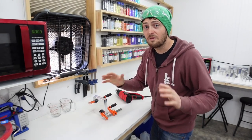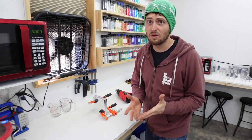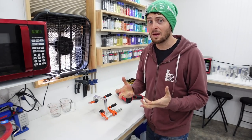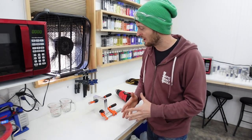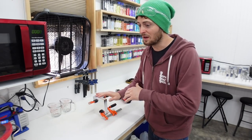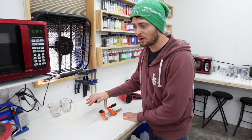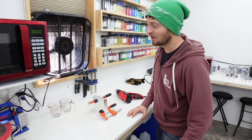That's all nice and warm now. If you're going to shoot laminates, heat up your injectors and your mixing block to make sure you have really good flow - you're not cooling that plastic. You really want to know what temperature you're shooting at, especially if you're troubleshooting other molds. It is key to make sure everything is not super cold. If you have a metal workbench, that's going to suck all the heat out of your aluminum mold, so we like to work on wood - it's more insulating.